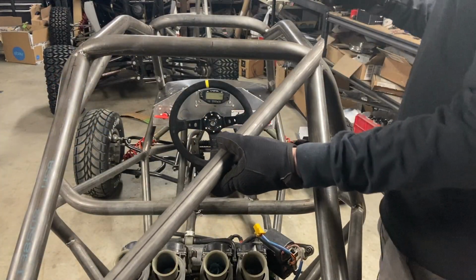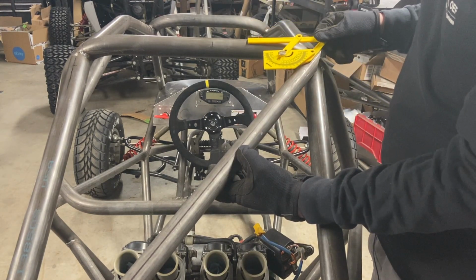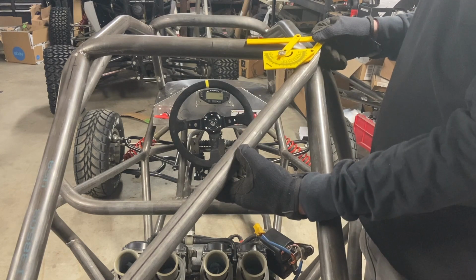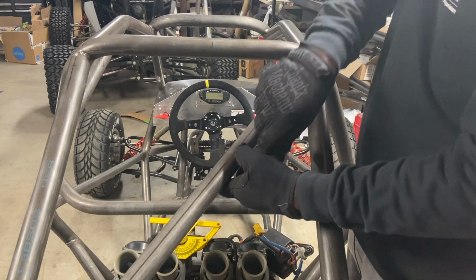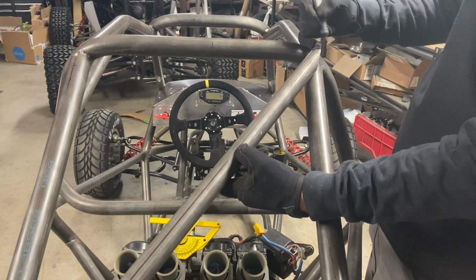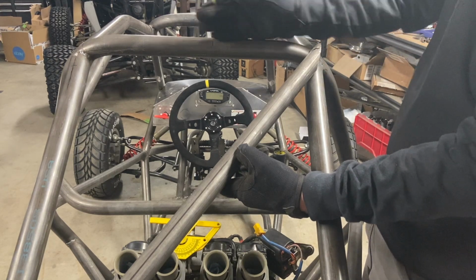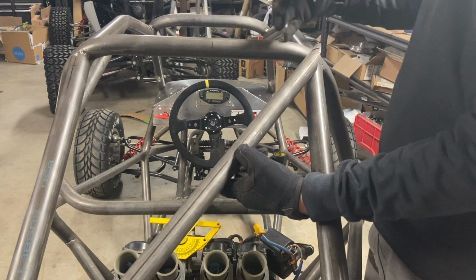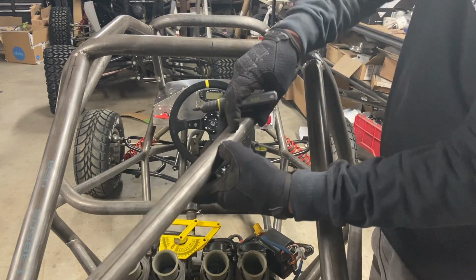All right, so now you want to measure up your second notch. Make sure your reference line is vertical. Slide your angle finder in, and this looks like it's 35, 125, or 55, whichever one makes sense. Now, I know you don't like me saying whatever makes sense, so what you can do to help find what makes sense is take this line and just transpose it onto here. We want to go about halfway through this notch, and we want to align this. So when your hole saw is aligned with this line, whichever one of those three numbers makes sense for this is going to make this a double fish mouth notch, and it's just going to slide in there nicely.